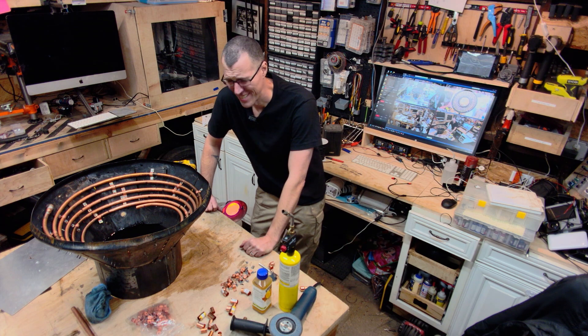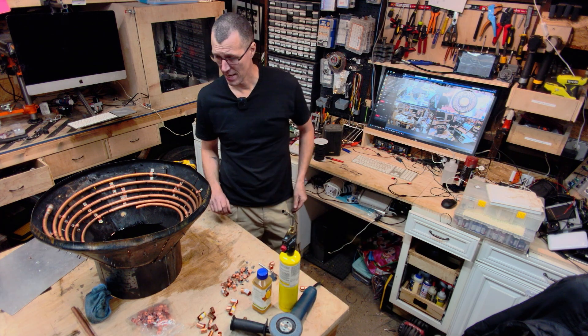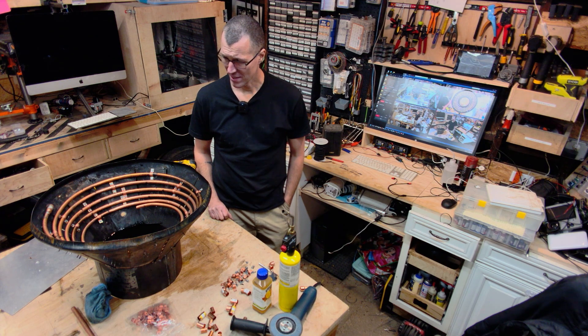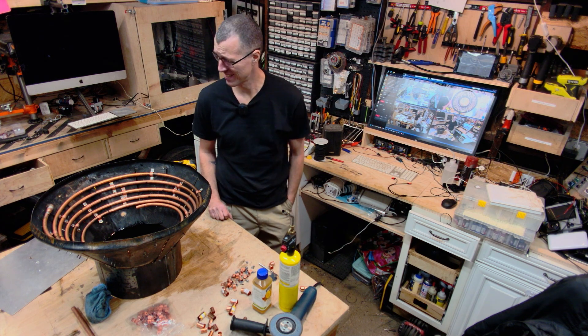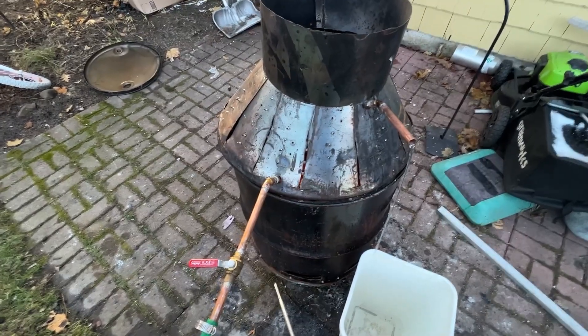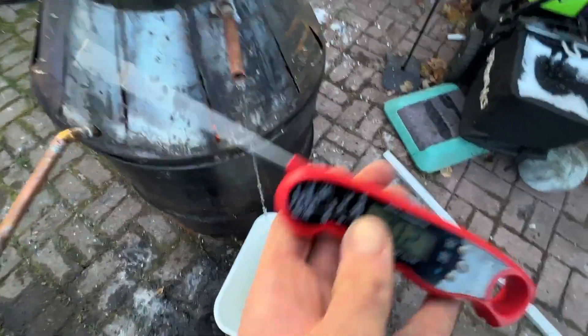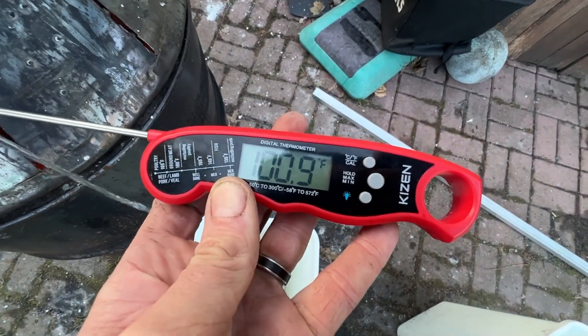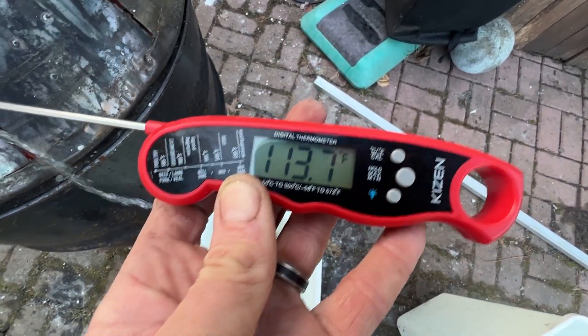This is the third rendition of the water heater coil. It's going to get covered with soot, which I don't think is good, but I don't think it'll be so hot that the solder melts. Maybe it will - that could be really bad. We'll find out, I guess. Now the fire could definitely be bigger, I can definitely make the burn more efficient. But right now the water coming out is keeping in mind this is at a rate of 15 gallons per hour for a pump that's rated at roughly 10 times that.